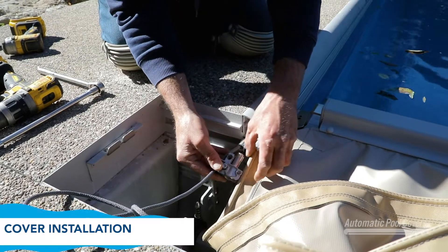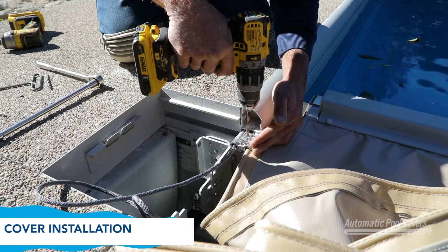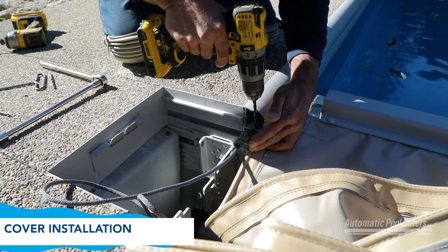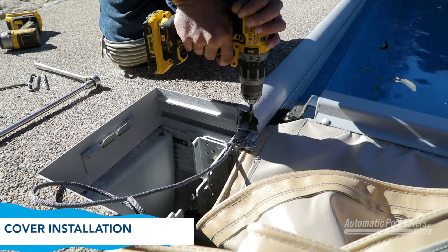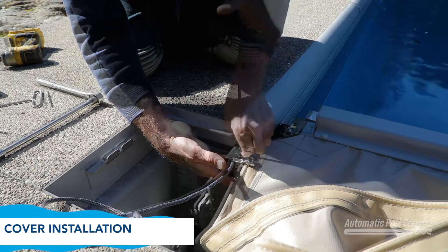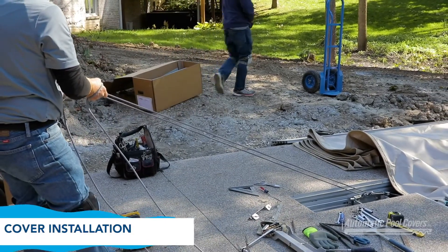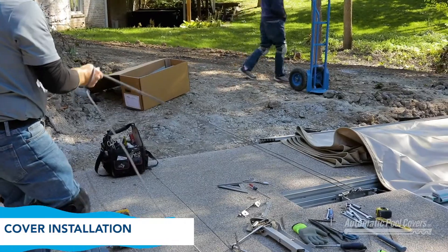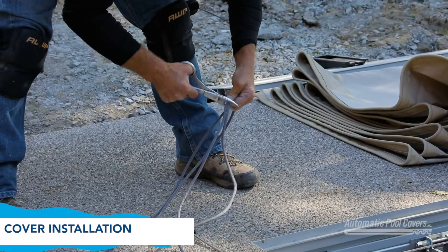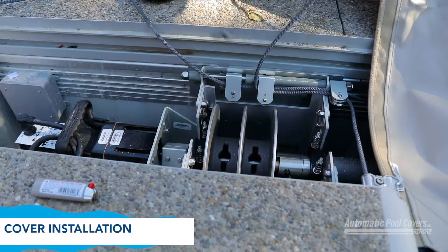With both corners of the cover in the track, install the guides. Use the top half of the guide as a template and drill the hole for your hardware. Use a quarter-inch bit to make the hole, then remove the top half of the guide and use a slightly larger bit to make installation easier. Fasten the guides to the track with the supplied hardware. Insert the remaining cap screw into the back end of the guide and fasten together with a nut. Adjust the lead edge until it's parallel to the wall cap by gently pulling on the appropriate rope. When you're satisfied with the position, measure the rope 8 to 10 feet from the front edge of the box and cut each rope in the same place. Tie knots in the end of the rope and insert into the appropriate side of the rope reel.